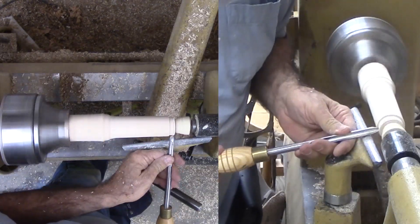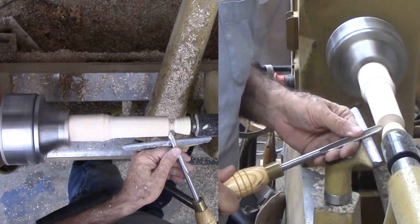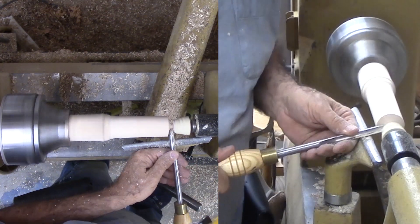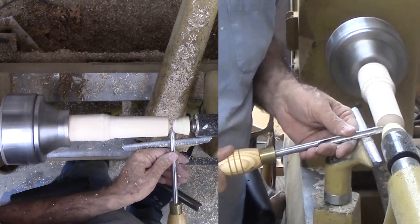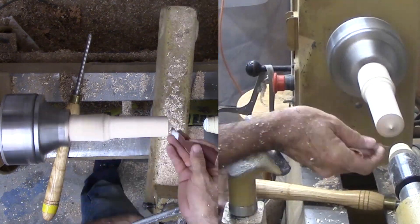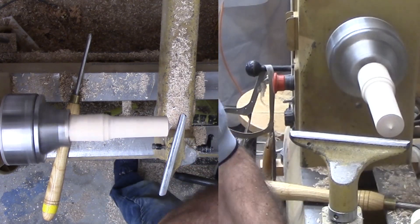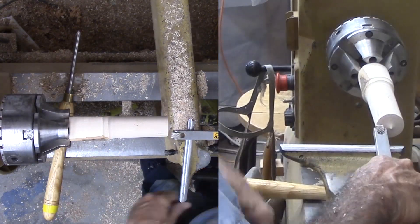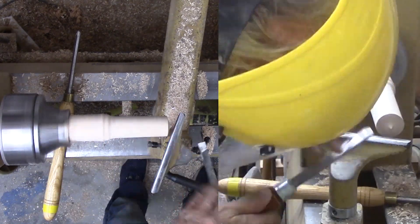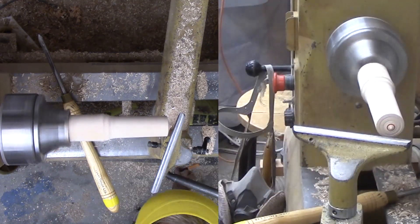Because the wood is hanging a long way from the headstock but I still want live center support, I put a rubber stopper on my live center for insurance. My tool now is a spindle gouge. I cut a shallow concave area between the rim and the point, and I also cut back the diameter just a little — you'll see why shortly. Spindles of this size do not take much to sand. For the bottom, I'm using a Wagner texture tool. I mark the edges with a skew followed by some colored lines with Tombow markers. Finally, a quick shot of rattle can lacquer to lock in the color.